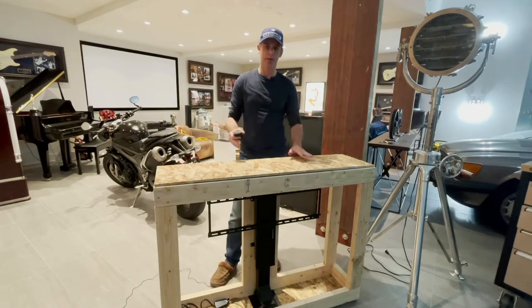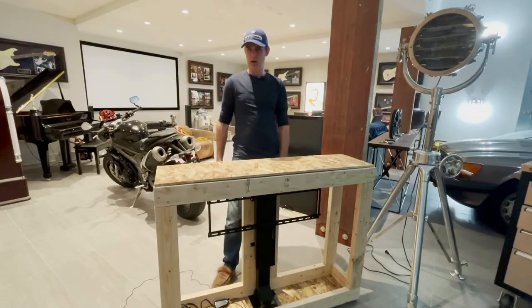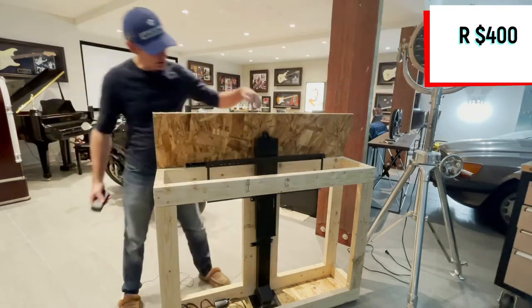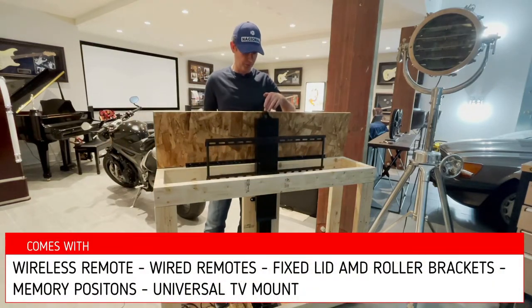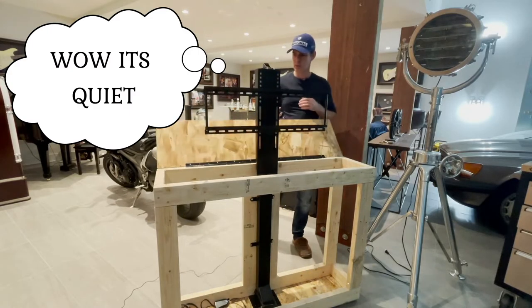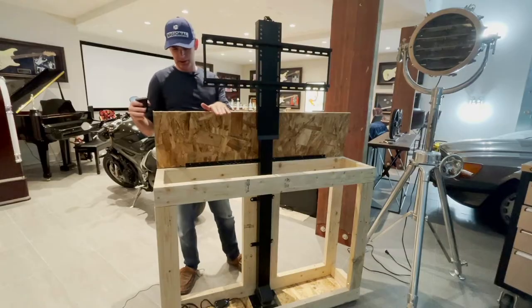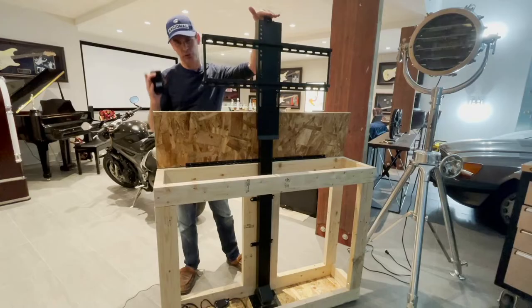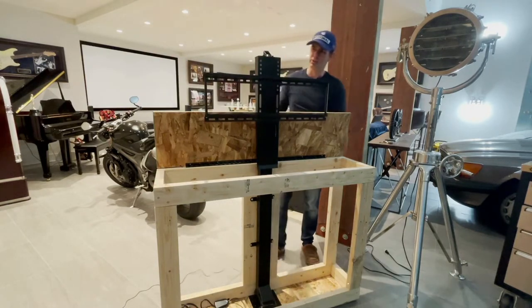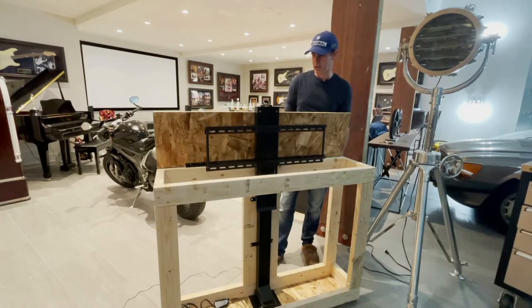The cabinet frame is now done with the flip-back lid using the piano hinge — it's very simple, just another piece that fits on the top. As you can see, it uses this roller feature that fits on the top of the TV lift mechanism and slides it back, but not so far that the lid falls backwards. It's just a couple of degrees. The rollback feature is very simple, very easy to install, and only adds an extra inch and a half to the top of the mechanism.